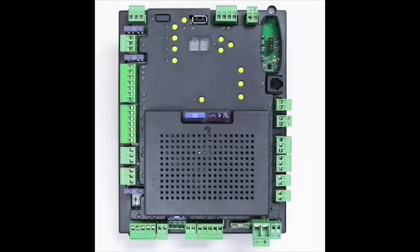Let's look briefly at those input and output designations. Along the input side of the board, you will find three auxiliary ports. Each of these ports can provide fused 12-volt power and serve as dry contact step inputs. This 7-terminal port has designators for open, close, stop, edge, and hard shutdown reset connections. This 7-terminal port has designators for safety, shadow, and free exit loop connections. UL and FIRE designators are located on this 3-terminal port below. As with all other accessory ports on this board, each of these designators has its own ground terminal.